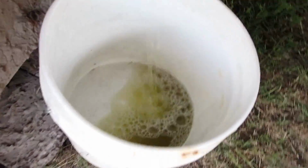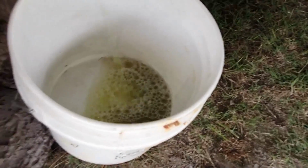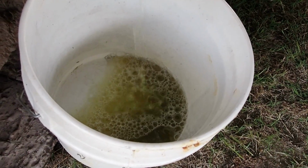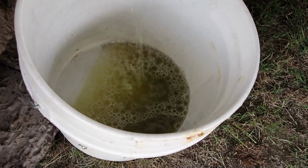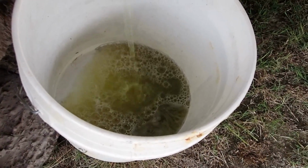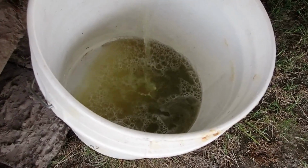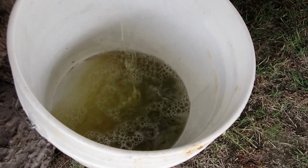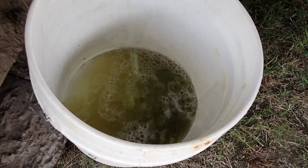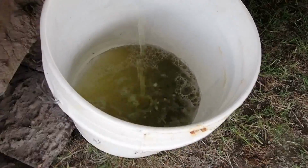That was pure water I put in there, and I flushed it before till it was clean. Pure water and that cleaner that I put in there, it was clear too, so looks like some good junk coming out of there. But I'll drain this, flush it out, and fill it back up with some antifreeze and water.